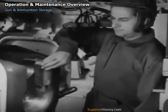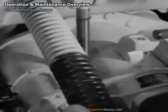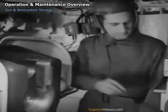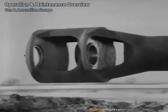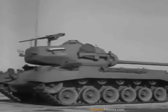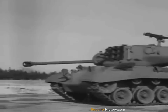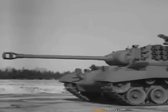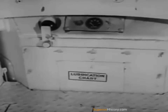A few years ago, no one thought a 90-millimeter gun could be mounted in a tank. But ordnance ingenuity developed a hydro spring recoil mechanism, making use of this big gun possible. Recoil is cut down to a minimum by this mechanism with an assist from the muzzle brake on the tube. The turret is traversed by an oil gear system requiring an electric motor — this means that when the tank is used as stationary artillery, a source of electricity is needed for the power traverse. An auxiliary engine on the right of the tank engine drives a generator which supplies the electricity needed, and the auxiliary engine has its own starter which can be reached from the fighting compartment.